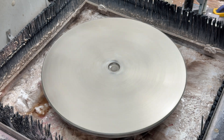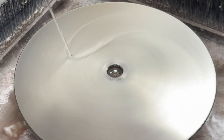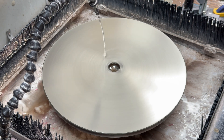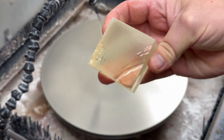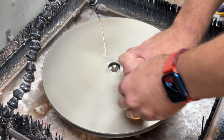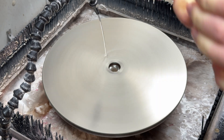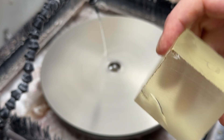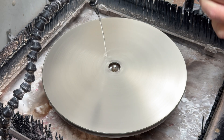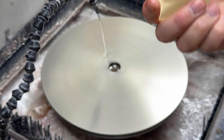So we're going to turn our wheel head back on and flush our disc with a lot of water to get all that debris off the surface of our disc. Now we've got our glass piece again — still have a little bit of texture showing there and a little chip. Let's see what this does now. Now you may be able to tell just from the sound and the amount of glass coming off that that's quite a bit more aggressive on the glass already. Taking a fair amount of glass off this piece very quickly — you can see the glass coming off on the disc as I'm grinding, whereas you really couldn't see that before. So that has really upped the aggressiveness of this 60 grit pad very, very quickly.